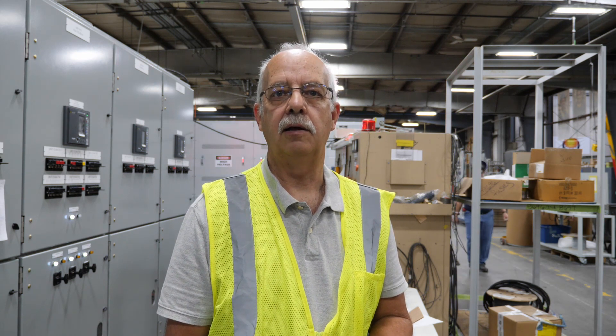There's a lot of background noise here because we are in a factory, but I want to explain a little bit about how we power up this gear temporarily. What you see behind me is a flashing light on the temporary power source to supply control power to the relays. This is so that preliminary testing can be done and the engineering firm or the customer can load protection settings into the relay and check the relay functions. There is no 13.8 kV power on here yet — they do have the capability of supplying that for testing PTs, but that will be done at a later time.